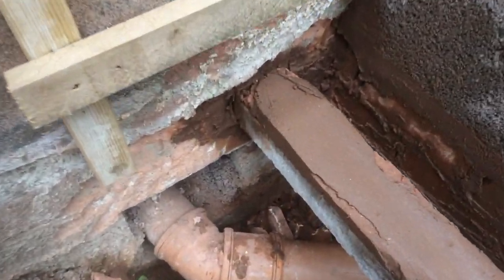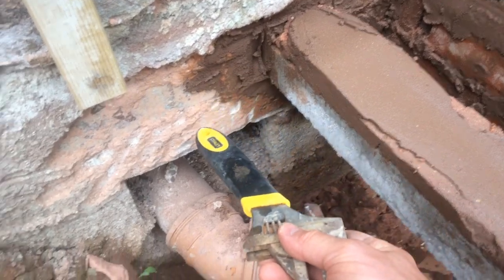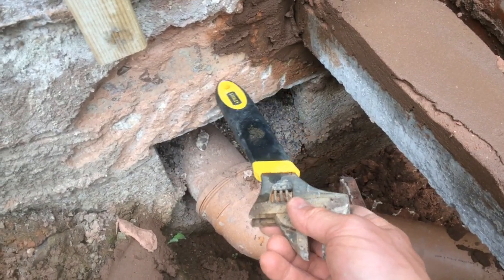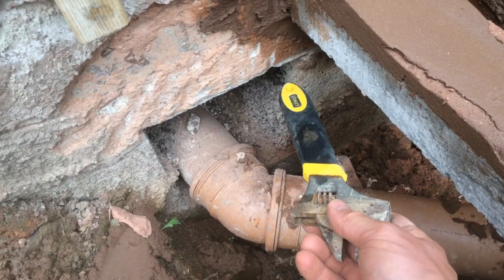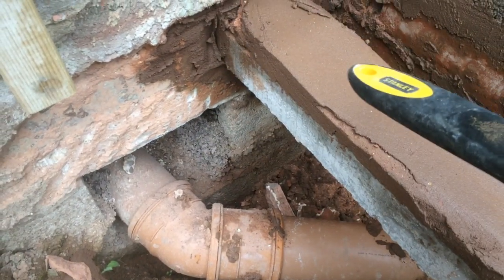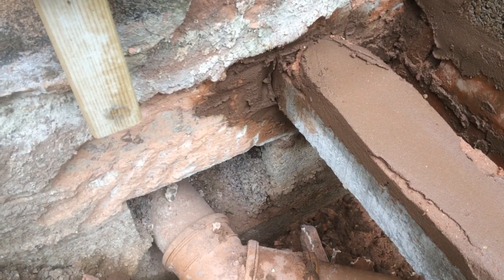So how I did this: I took a lintel here which goes over this existing waste pipe where it came out before, and obviously I didn't want to chisel out part of the lintel. I couldn't go below it because it wouldn't get a full bearing below on that block, so I've had to come above that one. Which means that my DPC is resting directly on this lintel, or on this bed of mortar which I put on top of it. So that looks a bit weird.